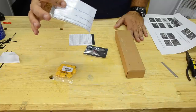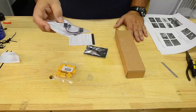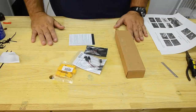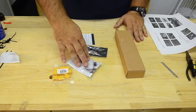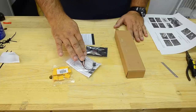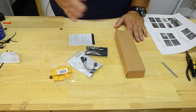This one's pretty cheap. I'll put links to all this stuff down in the description. It was a couple bucks, but literally you just wire this into a connector, any one of the connectors on your receiver, and then it watches for deflection. Now this one's kind of picky. It wants to see full deflection to turn off. So I generally put this on my rudder channel and I'll bang my rudders around every now and then to get it to go off.